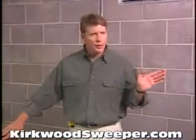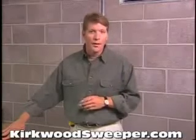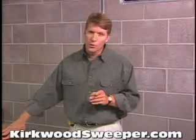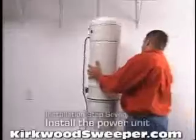If you have to drill through blocks or concrete, you'll probably have to rent a hammer drill or masonry hole saw. Then, run the tubing through and patch the hole once you're up and running. Before drilling, check your local building code for special firewall penetration regulations. Your code will also tell you if steel tubing is required.